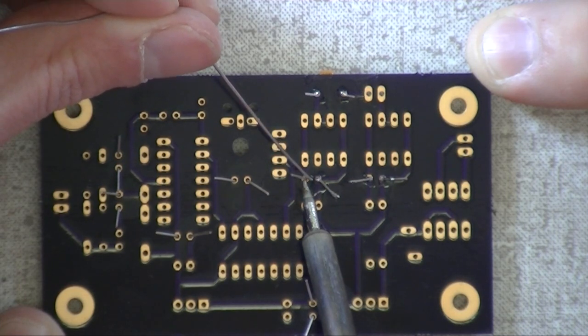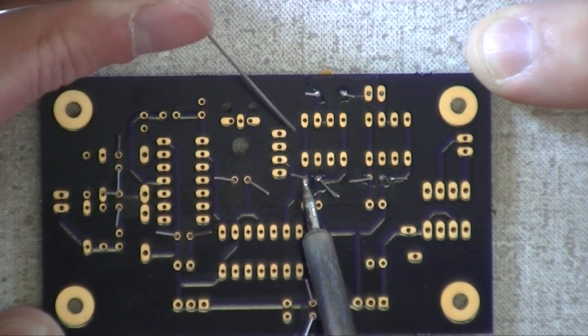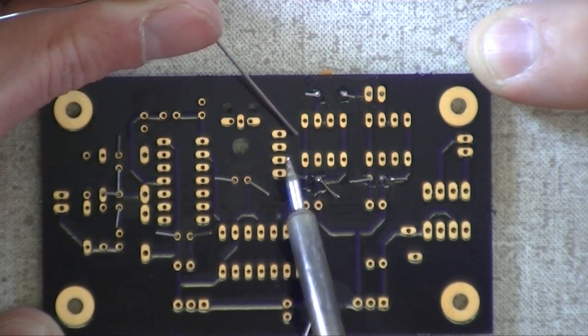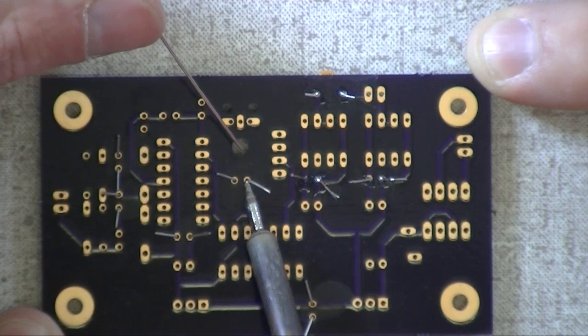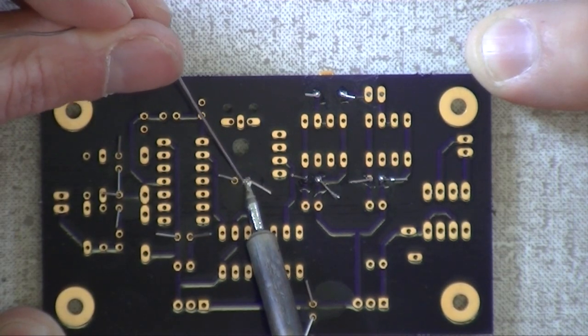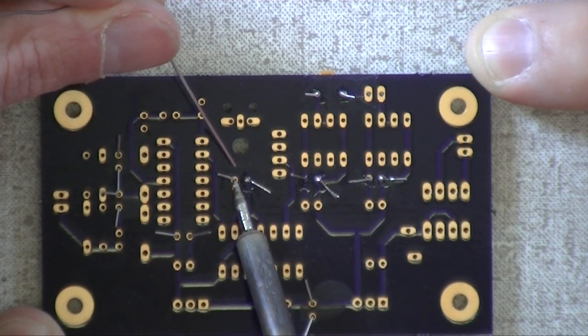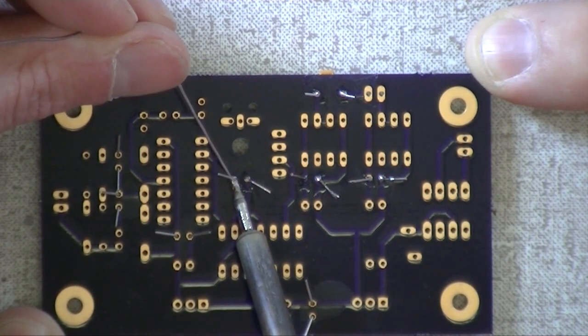Tell them some basics on soldering while I do. Basics on soldering. Well, solder has nothing to do with pressure. You don't press. If you press, you'll dig the soldering iron into the board and make a divot and might even rip the annular ring off the board in the process. How many times have you done that, Paul? Enough that I know you're not supposed to.